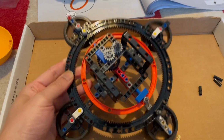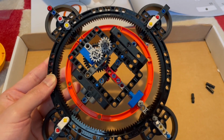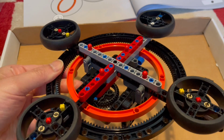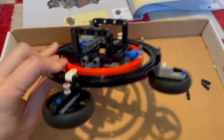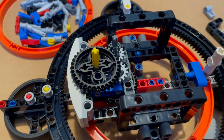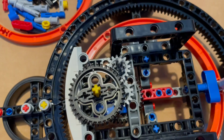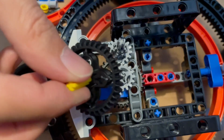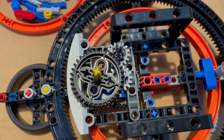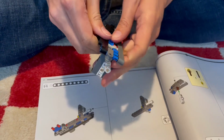Moving on to the build itself, the banana gears, another relatively expensive part, don't even get used as gears. They form a round structural element instead. One of the earliest actual gear stages has a diagonal and incorrect gear spacing. The 8 and 36 tooth gears are slightly further apart than they should be.